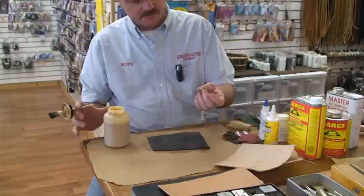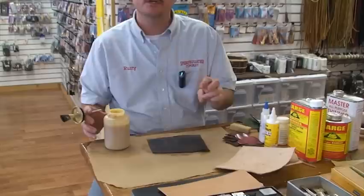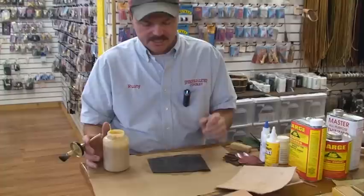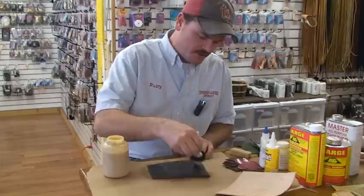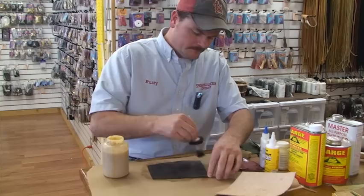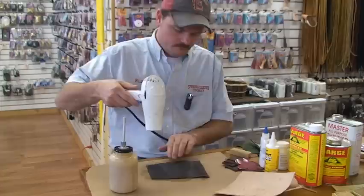This really should be about dry enough that it doesn't stick. If you've got glue on your fingers like I do, it's going to stick to that — but for the most part it should be dry enough that it doesn't really pick up when you tap on it. You don't want it as wet as that. Like I said, on your first coat it can be absolutely dry. After about a 20-minute period on your second coat, or a 30-minute period, it's going to dry so much that you're not going to get a good adhesion. So you want to make sure on your final coat, whether you're doing a two-coat or one-coat, that you really don't let it set too long — but you don't want it too wet either.